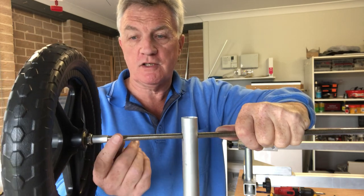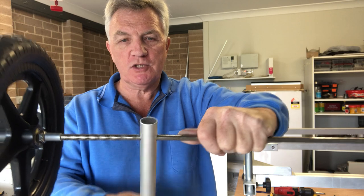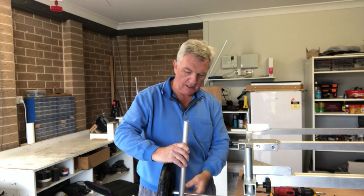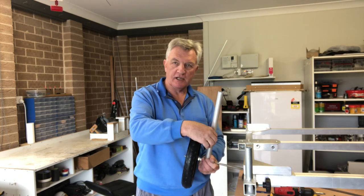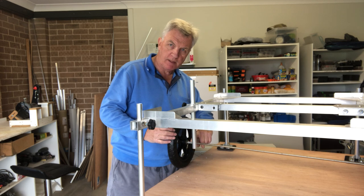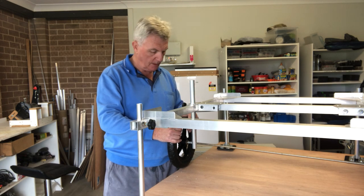This is just a section of 20mm tube which I've cut off to create a standoff. It's 25mm aluminium tube with 1.6mm wall depth. That sits in here and goes through. By putting this 20mm spacer in here it's stood off away from this upright just in case we get any mud or grass going through — there's enough gap there to stop it from clogging up. I think I'm happy enough with that, so I'm going to fit the wheel on the other side and also put a sleeve of this same aluminium material across to hold everything in place.